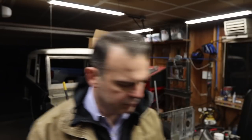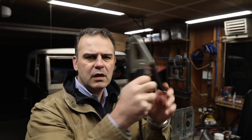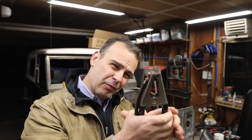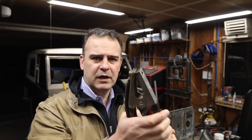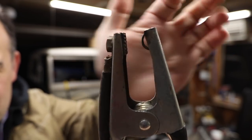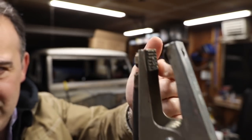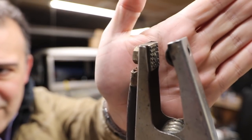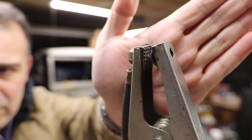But what's unbelievable is, despite it being a pretty high-end welder, it comes with this welding clamp. The handles are plasti-dipped. It's got a pretty stiff thing, but if you look closely, it's just a rounded half circle and these teeth — and the teeth have just gone down to nothing — and I'm just not getting a good positive ground.